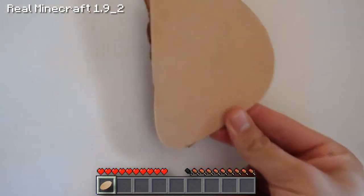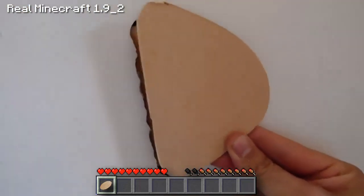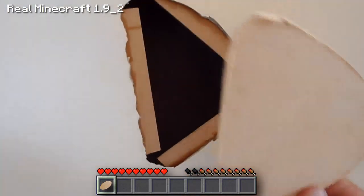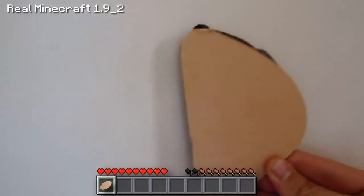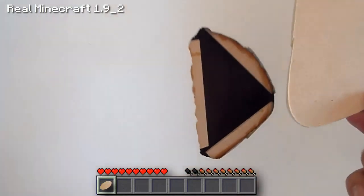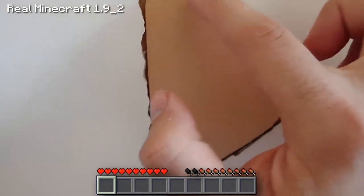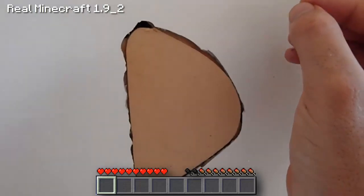But what I've done is I've cut out, using that wood over there and a coping saw, basically the shape of that hole in the wall. It doesn't have to be perfect. Then I'll glue on the outside, I'll stick it on there, so the outside edges here will glue onto those edges there, and then we'll putty it up, sand it, and then paint it, and then she'll be sweet. So I'll come back when I've glued this onto there. See you soon. So what I've just done is glued that piece of board that I've cut out with that glue, and stuck it on there so the glue has touched those sides. Let that dry for a couple of hours before I get the putty out. I'm going to putty it, then sand it back, and then paint it.